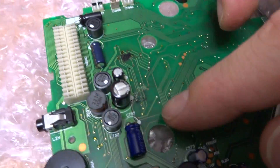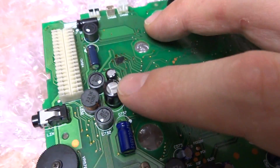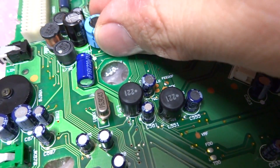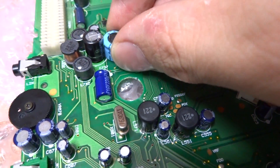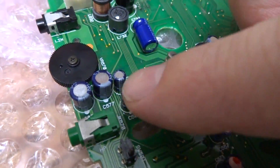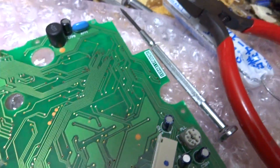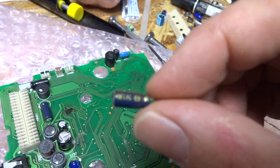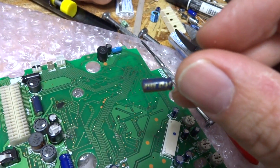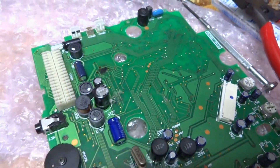There were a couple so far that I've had to put down on their sides just because they're too tall. This one here is going to be iffy — the original sits about this tall, so there's a little difference. As long as it doesn't hit the top part of the lid it should be all right. The difficult part is going to be over in this section because the 220s and 47 microfarad capacitors are the longer ones, so this is going to be a little bit tricky.